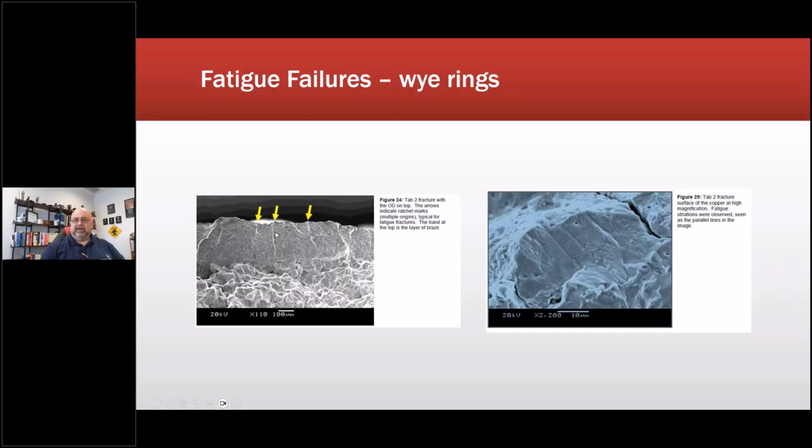That's the fatiguing here of an unfailed portion of a Y ring that failed. That fatiguing was causing them to break, usually right about where they were annealed, because they were brazed in place. The heat would anneal it, and then there would be a fine line where it was hardened versus soft. That movement and all the flexion due to the constantly changing magnetic field fatigued that ring, and then they start to fracture. Every single doubly fed induction generator on the planet is going to fail the same way.